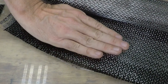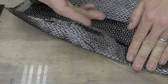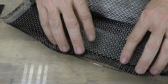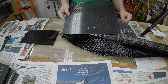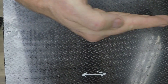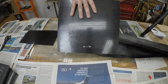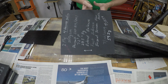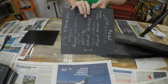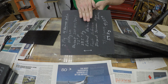So most of the fabric on this face is running this direction. Now let's flip it over. Most of the fabric on this side is running 90 degrees — this direction — where you have three over and one under going this way. Now let's look at the piece we tested in the last video. This is that same four-harness satin — you can see three over, one under — so most of the fabric is running in this direction on this side. Now this is two-ply, meaning two layers of fabric. On the back side, the three-overs are also running in this direction. On both sides, the three-overs are running in the same direction. That means the two middle sides are running the other way.